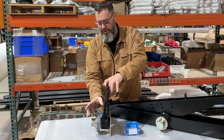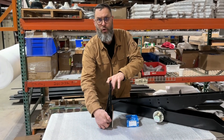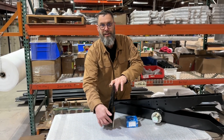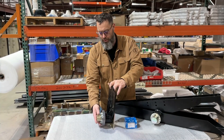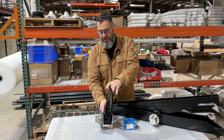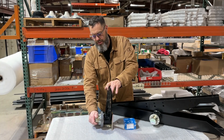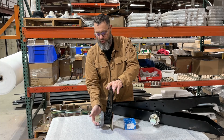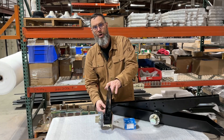When this pivot is coming up, if this slides out, you will be deflecting and deforming that weld or the plate. We have seen an issue with cracked and broken welds. So we want to make sure that this application does not allow for the bronze bushing to slide, which would create torsional twist on the end of the shaft and put undue fatigue stress onto the welding plate.